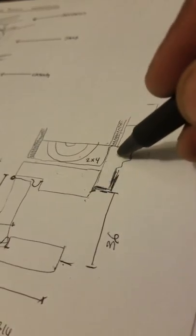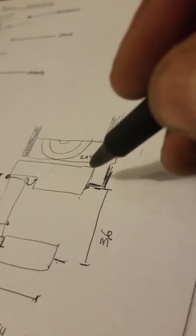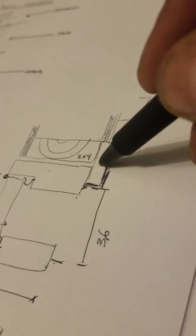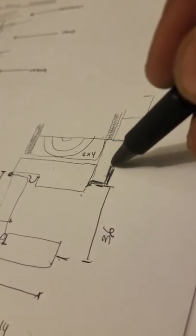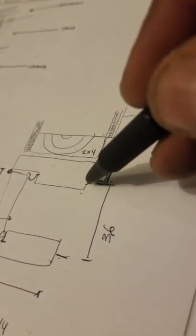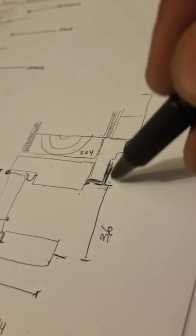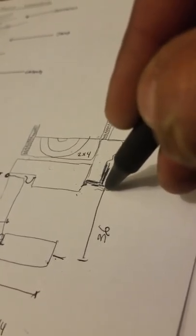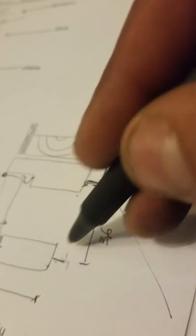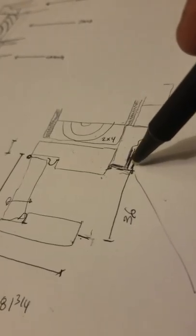Sometimes the brick mold is only a three-quarter inch piece — that's okay for cheaper storm doors with thinner rails. But 90% of installs today use a thicker piece that's at least an inch and an eighth projection outward. It gets installed a half inch setback and provides at least one inch of clean space for the storm door Z-bar. The storm door has hinges and works in this area, with another frame that the door bumps against — the same principle, just measured on the brick mold side.